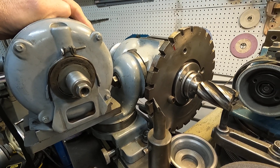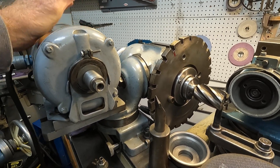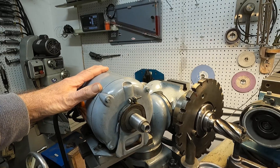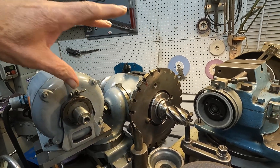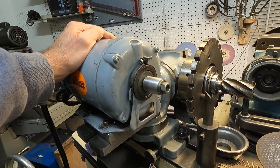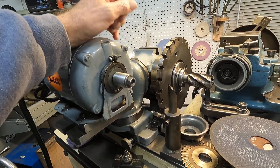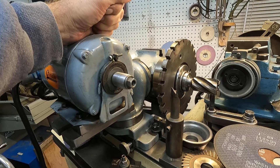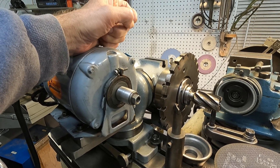I'm going to figure out how to adapt a 40-taper to this Cincinnati head that's on here. This motor here is not stock either. The stock motor setup is kind of ridiculous — it's got a big pulley, uses a V-belt and a high-speed motor. What I did was find a 1100 RPM motor and made my own pulleys and some flat belts that I modified from micro groove belts. I'll show that in the next video.